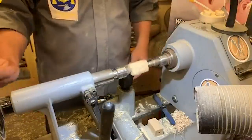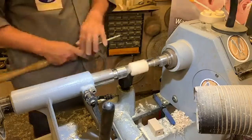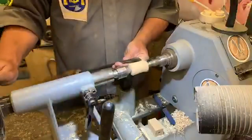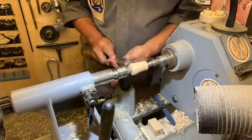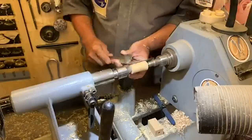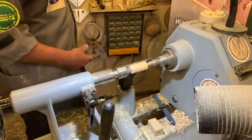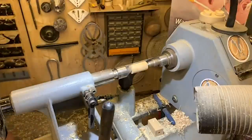The tool rest is set. It's a dinky little bit of timber, so from zero we'll turn the speed up quite quickly — above 2000 revs — and go with a nice big skew. With friction drives you will get a little bit of slippage; they settle down after a while, so don't worry too much. We want to make sure they're the same size — you can use your parting tool for that. The dimensions: legs are 22mm diameter by 45mm length. Hole size is 6mm.